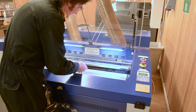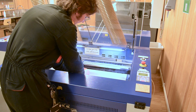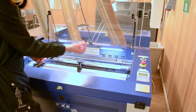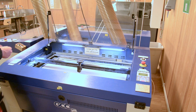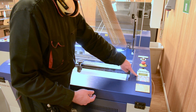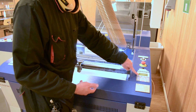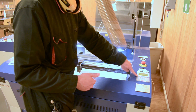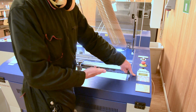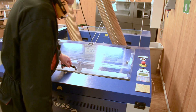When you remove the AUTO FOCUS pin, gently hold the head, use your long finger as a support, and carefully pinch it out. Reposition it into the AUTO FOCUS pin holder. When AUTO FOCUS is complete, you must press the FUNCTION 1 key. The function of each key is always labeled directly above it — FUNCTION 1 is now BACK, and pressing BACK confirms the location of the work table. You can then close the glass door and return to the computer.